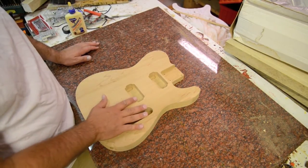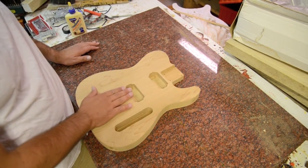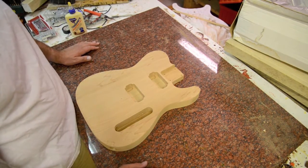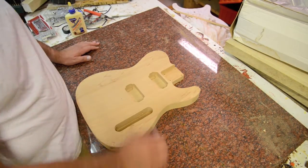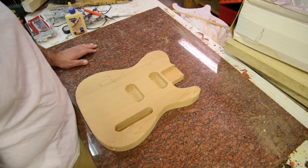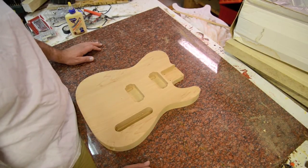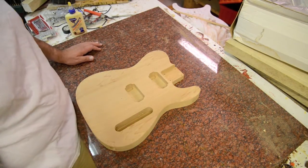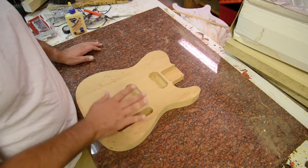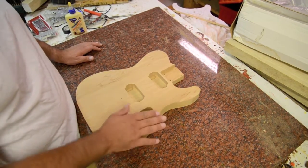I don't think you see a lot of solid body guitars made out of this. You'll see some acoustic tops and backs, but overall I think it's a good wood. It's got decent workability, but it does contain some sap, so you've got to be careful with that. You'll see a lot of closets lined with this material as well — if you stink really bad, this would be a good guitar because it has just a beautiful fragrance. They put this in closets to keep moths away because of its smell. Overall, red western cedar is a good wood to work with. You can find it at your local lumber yard, and you can also find it kiln dried. This is 8 quarters, so this is a little bit higher end quarter-sawn for guitar tops.